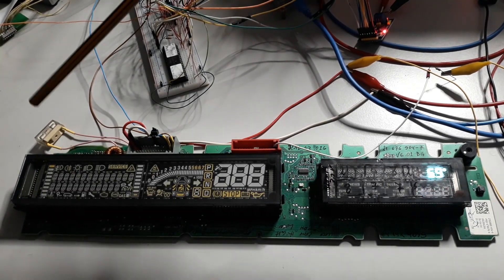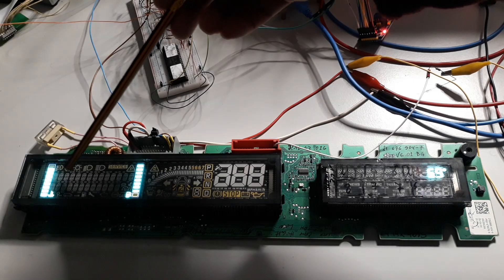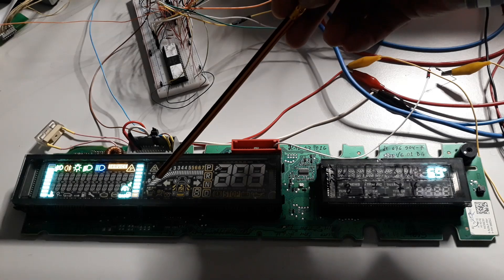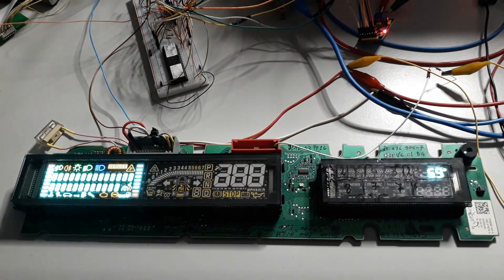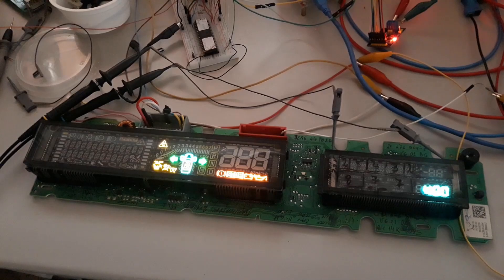As I referred, the grids start at the left with order: three, four, five, six, seven, eight, nine, one, and two. The hours stay blinking after the power is disconnected. To set the clock, you keep pressure on this button — the hours stay blinking and you can advance the hour. If you wait some time, the minutes blink and you can adjust the minutes as well.